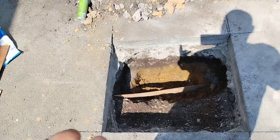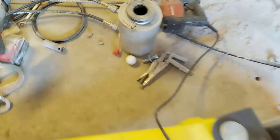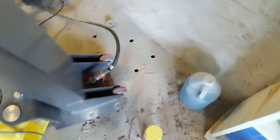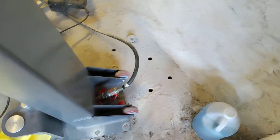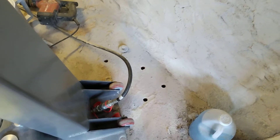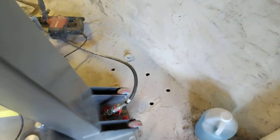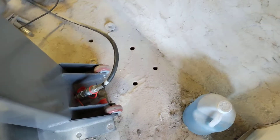As you can see, it's a much more significant hole for the exterior one. I'm putting my rebar pullout test on this as an anchor test — it's an extension of the all-thread with wedges, correlating kilonewtons to pounds of force. I'm proof-testing mine; I recommend you do the same. Hire an engineer locally to do the proof test for you, and then you'll know. Do all the redundancy I'm thinking through for you, but I can't really tell you 'do this' — I'm just showing my steps to verify I don't kill myself.